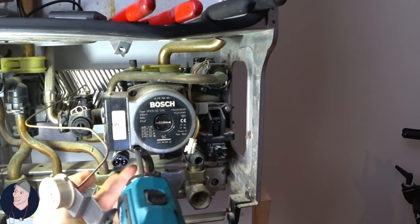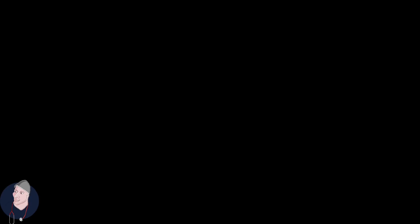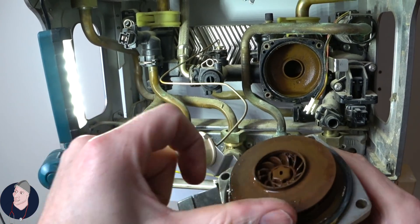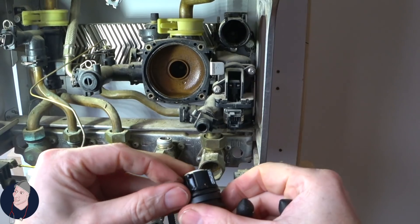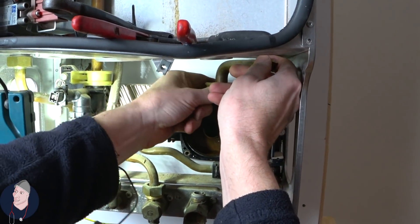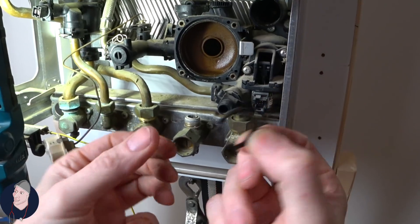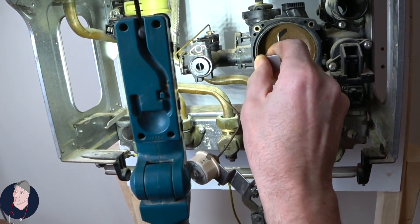Gauge off, pump out. Crack the pump. You can see the general state — there's also some fragments in here, two big lumps there and there. It'll start to perish. This is what I do: clamp that, twist, anti-clockwise. And an O-ring, washer on the top — don't lose it. Take the plate out, other side. Undo this clip which holds the pump to the body, pop that.